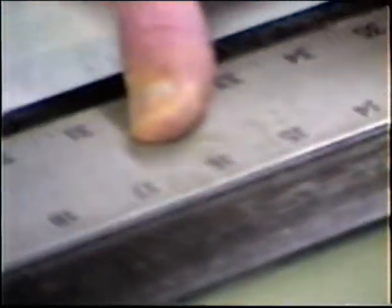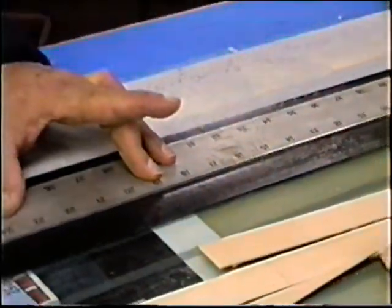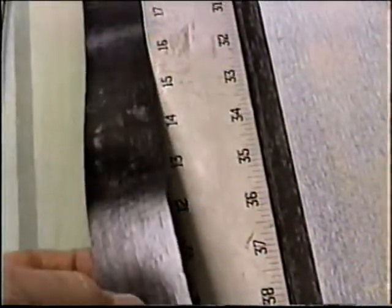Yeah, I understand the 7,000. But that's unidirectional. All the strength is in one direction. Yeah, the fibers are going lengthwise. One side usually has a finish that you can attach glue to, and I would say that's the side. But no, I roughen it up. No, it's not. When you look at the other side, when this is shiny like this, the glue doesn't stick as well as when it's rough. Wait a minute. The rougher, the better.